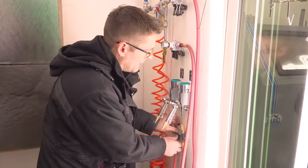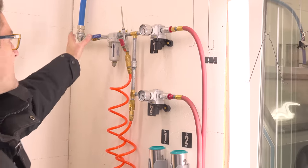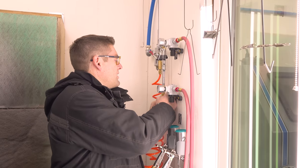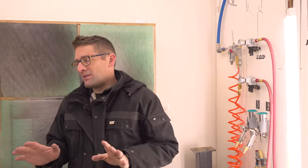There's a fair bit of expense in all the NPT pipe pieces and adapters, plus another trap and a ball valve. I assembled it from one direction and everything worked out great. If you don't want your air plumbing to leak, here's what I learned from a plumber: use really good pipe dope — like a Teflon paste — I use Super Blue for that. Then use quality Teflon tape like Mega Tape in blue or gray, which is much thicker than the wimpy white stuff. If you use the dope and the tape together it won't leak — close the ball valve and the pressure will stay for a week.